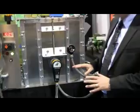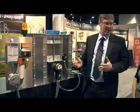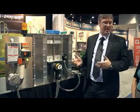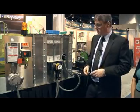I can show you how it is set up and how it's calibrated. What it's going to do is monitor the shaft speed of a bucket elevator or a belt conveyor, so that if the belt started to slip and the shaft started to slow down, at 10% under normal speed we will get an alarm, and at 20% below normal speed we'll get a shutdown.